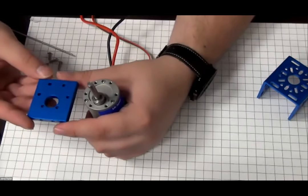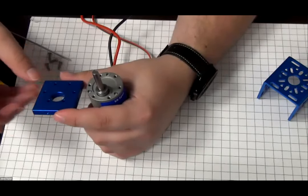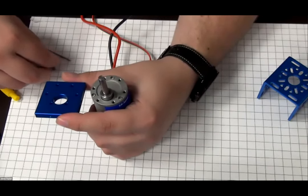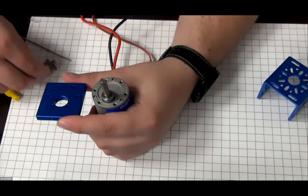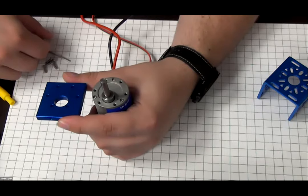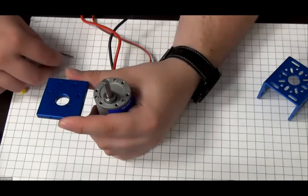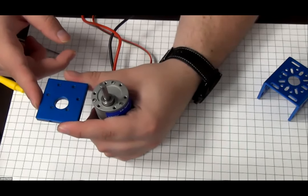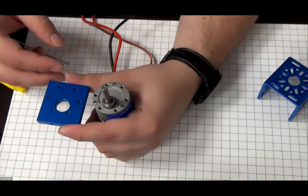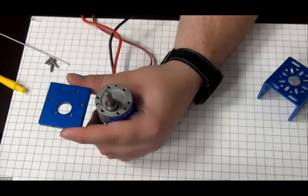You'll find it a little bit easier if you mount the motor to the motor mount plate. So take your Maverick motor. You're going to mount that to the motor mount plate, the 76140, first, and then you're going to put that into your 48 millimeter channel. It's just a little bit easier for you to work with. And it's technically a type of sub-assembly you can do, because it's much, much easier for me to slide a motor in and out this way than it is to pull the motor out this way when I'm trying to fix a robot.